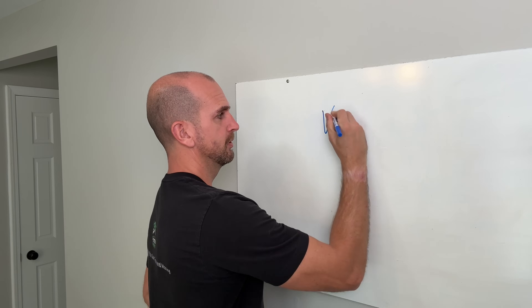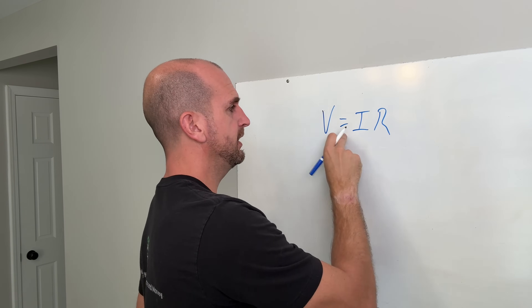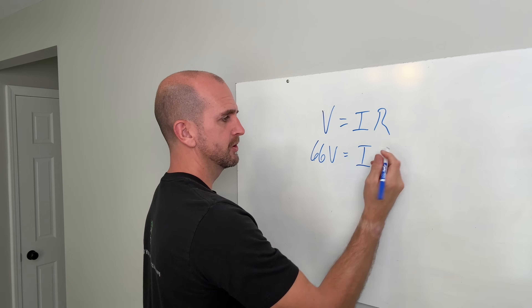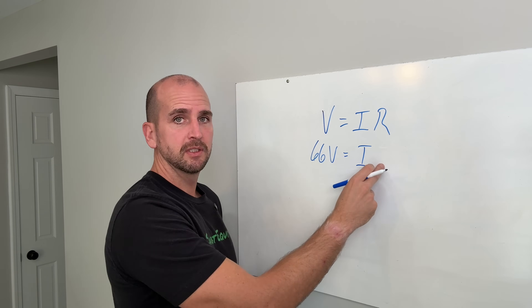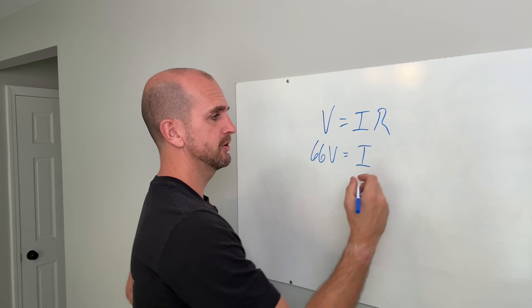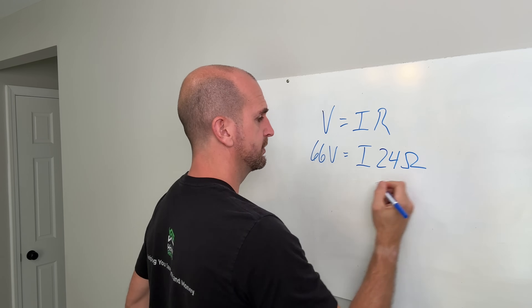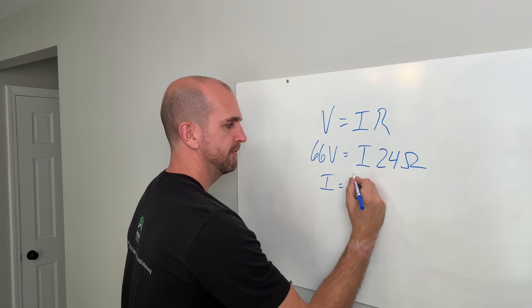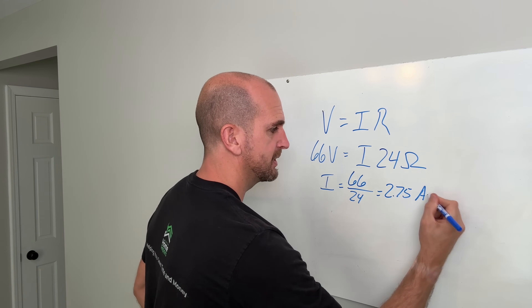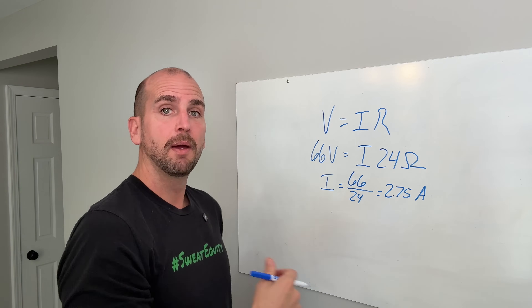You might be asking why we have two 320-watt panels — that should be 640 watts at standard test conditions — but we're only getting 170 or 180 watts. It's actually a simple relationship back to Ohm's Law: V = IR. Our voltage was 66 volts. To determine the expected current we need the resistance, which we measured at 24 ohms across the heating element — that is our resistor in the system. So you take 66 volts divided by 24 ohms and get 2.75 amps as your expected current, and that's exactly what we saw on the power analyzer.